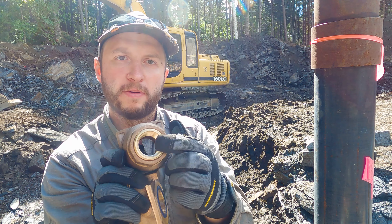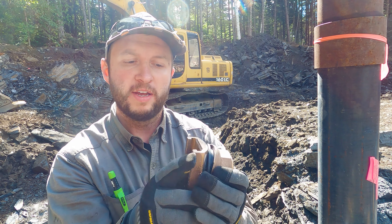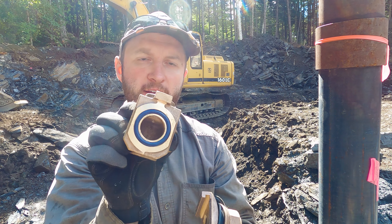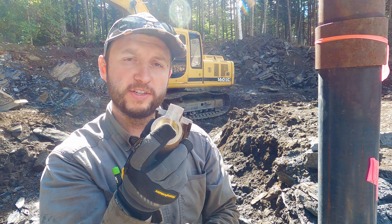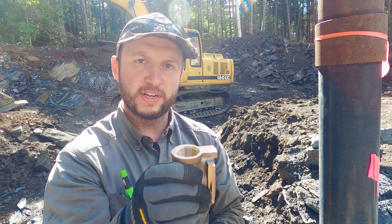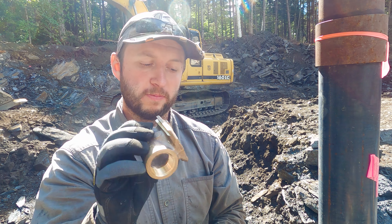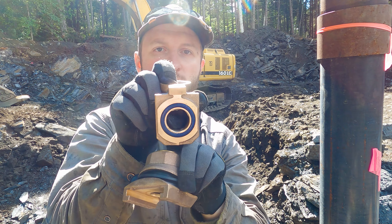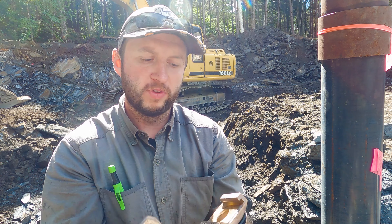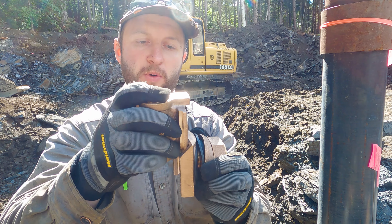This piece we're actually going to be installing in the well shaft itself. The well shaft will get sealed between these two pieces. This part screws on, and this piece here is going to be inside the well — it essentially creates a hole you can see right through the side of the well. We can then install our supply line going off to the utility building, and on the inside there's a rubber o-ring that will create a really tight connection.